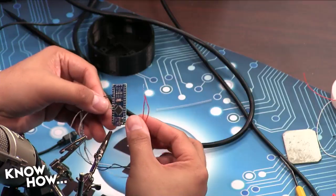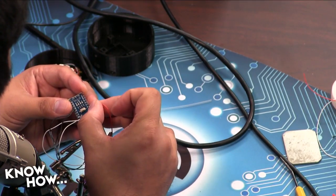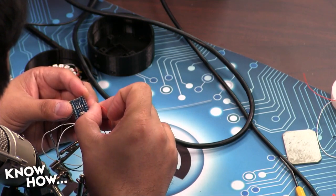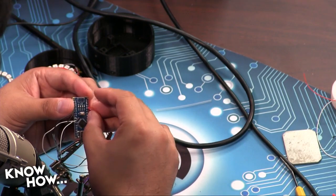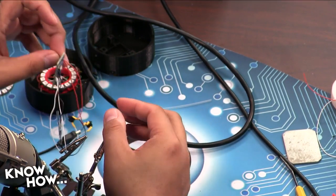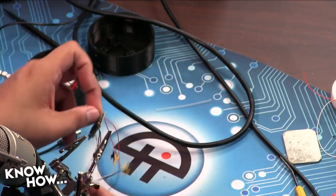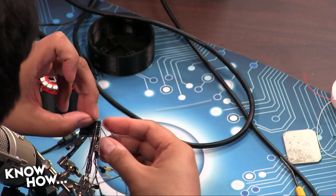All right, good. So here's the next part. Alex, if you come on over. I'm going to take the red leads, and I'm going to put it into the 5-volt hole. That will just mean that the Arduino itself will be supplying 5 volts to my switches, my buttons. There we go. So this one's going to hold the Arduino. This one's going to hold my wire.